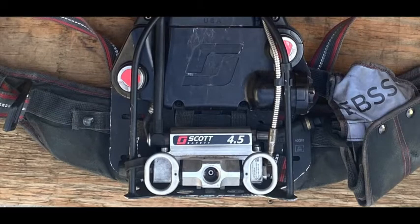This is the sensor module assembly. It alerts of a downed firefighter. Activation: green flashing LED lights with an activation chirp. Pre-alarm: motionless for 20 seconds, red flashing LED. To reset, move the SCBA or press the yellow reset button on the side of the control console. Full alarm: 10 to 12 seconds after pre-alarm, with red flashing LED lights. To reset, press the yellow button twice on the side of the control console. To turn it off, bleed air from the system, press the yellow reset button twice, and listen for confirmation deactivation chirp. If there's a low battery, you have orange flashing LED lights accompanied by a chirp every 2 seconds.